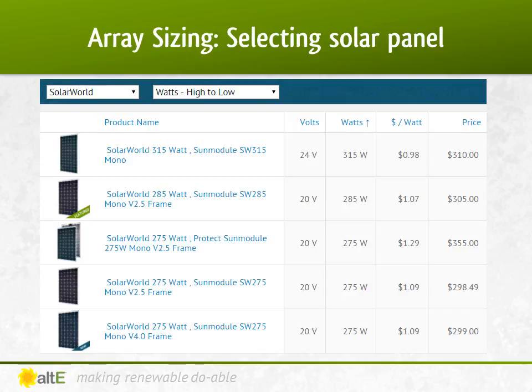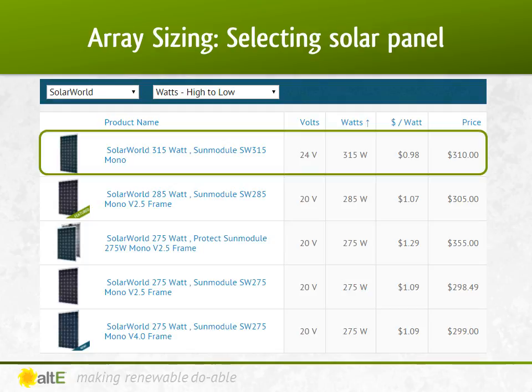There are so many options available for solar panels that selecting which panel to use may seem daunting. The first step is to narrow down what your priorities are: Do you want made in the USA or a specific country? Do you want the panel frames to be black or silver, and the cells to be black or blue? Is there a particular brand you want, or is cost the only criteria? For my system, I picked a nominal 24-volt made-in-the-USA panel — SolarWorld's 315-watt monocrystalline panel. If the panel you select doesn't say what its nominal voltage is, you can look at its specs. A 24-volt nominal panel has a VOC of about 46 volts, whereas a 20-volt nominal panel has a VOC of about 38 volts.